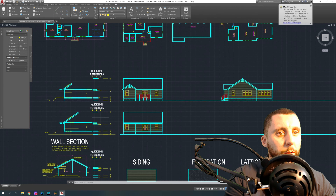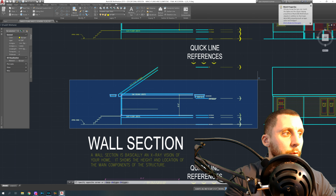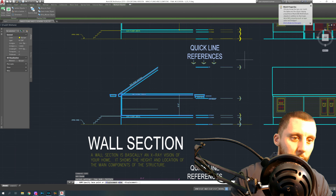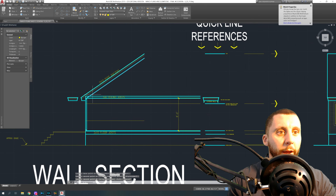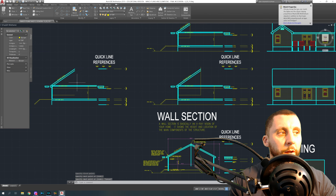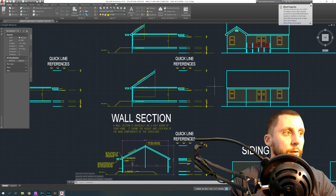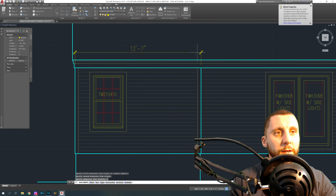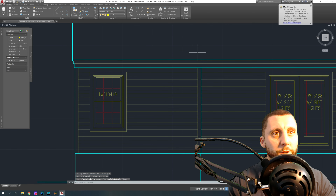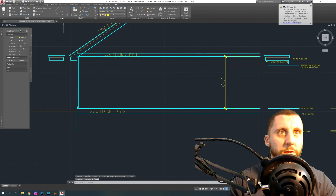What I do is take my wall section and copy it to the left. This wall section is set up for a 30-foot deep house — it will rise and run until it hits 15 feet, then come back down. So we drew a line 15 feet long, brought that line up, and knew where to trim it off. This other gable roof: from corner to corner it's 12 feet 7 inches, so it's going to run 6 feet 3 and a half inches before coming back down.